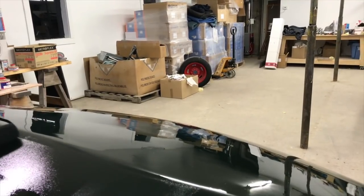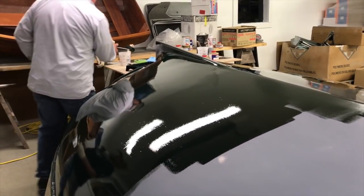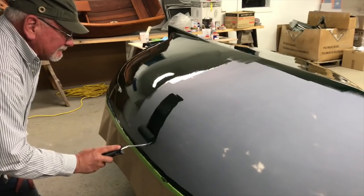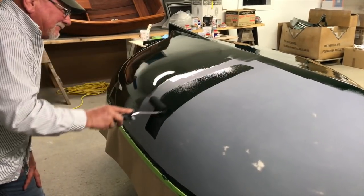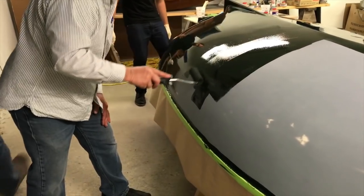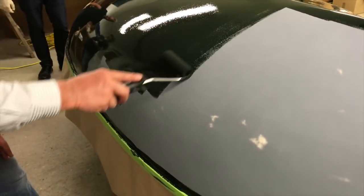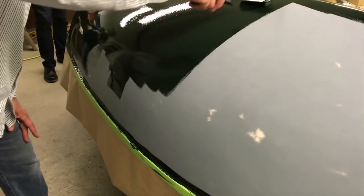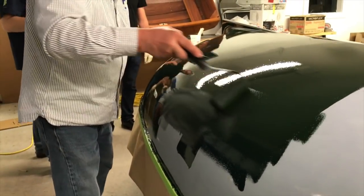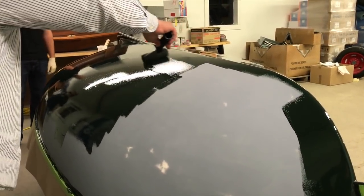The second person tries the roller. After getting a little heavy in one spot, Jason reassures them: if this is your first coat, come back tomorrow, let it sit and dry. Find the spots you don't like, sand them lightly, feather them out — you don't have to sand the whole thing, just fix the problem spots. You can still carry over the second coat without sanding the entire surface.